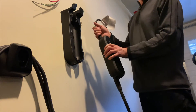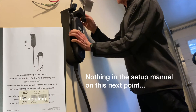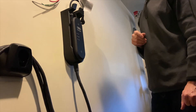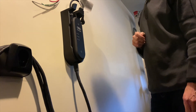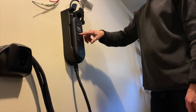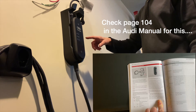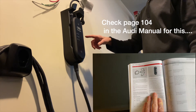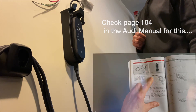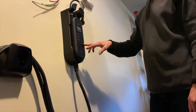It takes a long time to charge your vehicle off of 120V, and it'll probably draw the full 15 amps, which is generally what our house current is allowed to draw on a single circuit. But if you press the power button on the charger, the display will show a drop — it'll go from 100 to 50%. That's a pretty important number, because it means it will keep you below 15 amps. It'll take longer to charge but it won't overload your home electrical system.